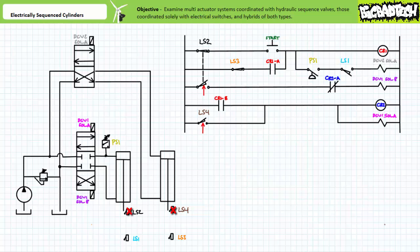Before taking a tour of the ladder logic diagram, note it incorporates two control relays — CR1 in red and CR2 in blue — and all contacts associated with a particular control relay have been assigned the same color. The first rung of the ladder logic diagram includes the normally open side of limit switch 2 being held closed by the fully retracted clamp cylinder. Note this switch is mechanically interlocked with a normally closed side being held open in rung 3. Rung 1 additionally includes a momentary contact normally open push button in series with the coil of control relay CR1. The second rung includes the normally closed limit switch 3 contact triggered by the fully extended bend cylinder.